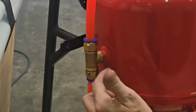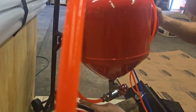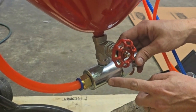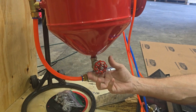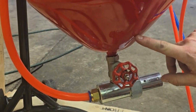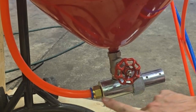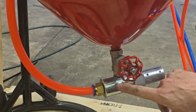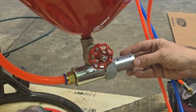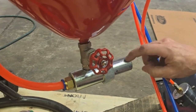In the event that everything is open, it pressurizes the tank as well as sends more pressurized air down through this PEX line to the bottom of the pressure pot where we have a mixing valve, or MV. You also have a regular valve like you'd operate with a water hose. The media — the pressurized media — comes down through here, assuming you've got that open, and mixes with straight incoming air right there. It all mixes and then comes out at this fitting, which is where the actual rubber hose attaches that you hold in your hand to do the blasting.